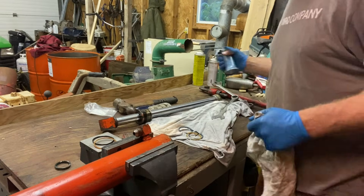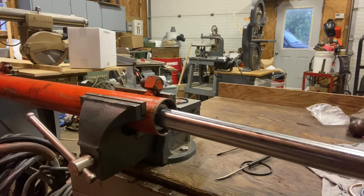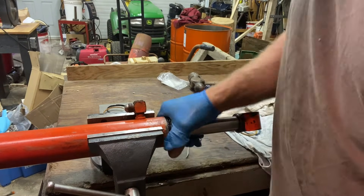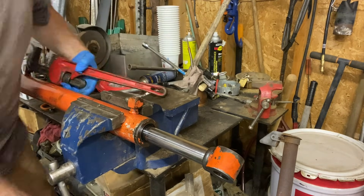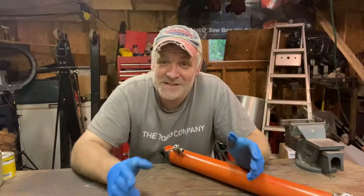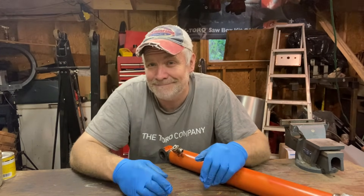Put a little bit of hydraulic oil in the bore. Now we're going to slide it in — the rings are expanded so it's going to take a bit. Push and wiggle around a little and it just slides in; you don't want to use a hammer. I'm going to throw it outside so my buddy can pick it up. I just wanted to make this video to show you guys that it isn't really that hard to rebuild a cylinder — most people with medium to moderate mechanical ability can do it. That's about enough for today — you guys have a good one.